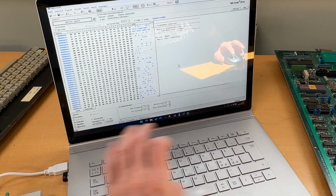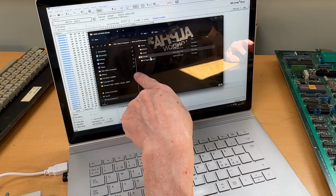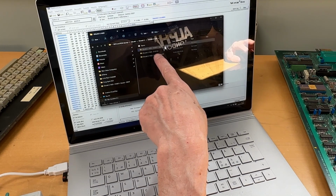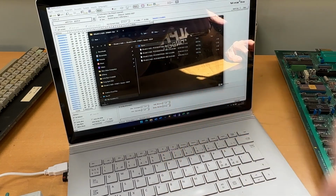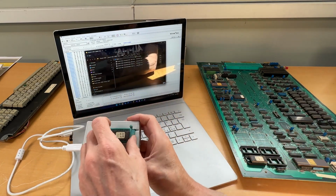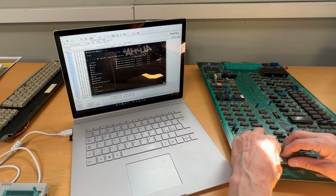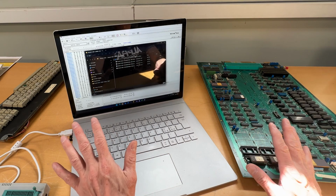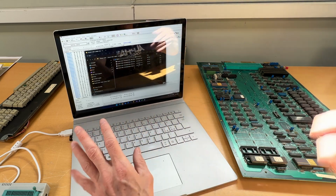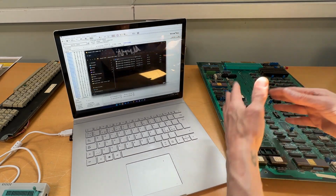And if I then go on my computer, I usually verify. So BIOS dumps, Olivetti L1 series, the M20, and this is this one, and I have them over here. So all good. So this one now goes out, and then it's going to be put into the board again, which then actually means that we are ready to assemble everything in the casing. The only thing we are missing, which will be the next thing, is the floppy disk drive. So let me just put everything back in the casing just so I don't have the motherboard floating. Everything, I mean the motherboard.